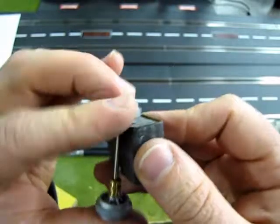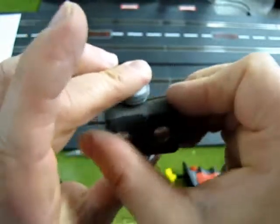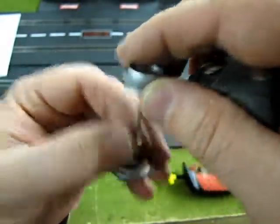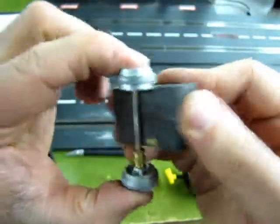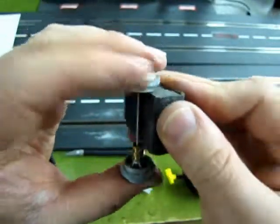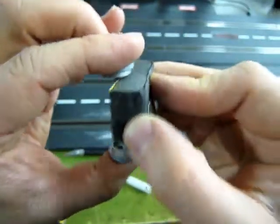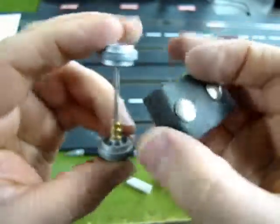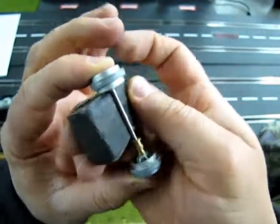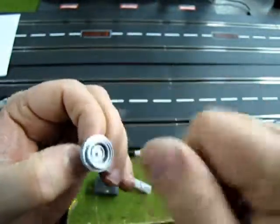Deburring the axle, which again is machining it. And just in case, remember to wipe the oil off of here if there's any, before you get your sandpaper all oily. This is actually wet dry sandpaper, which means you can use water on it too, which cleans the cutting surface. There. Now this should free up a little bit of room in the bearings.